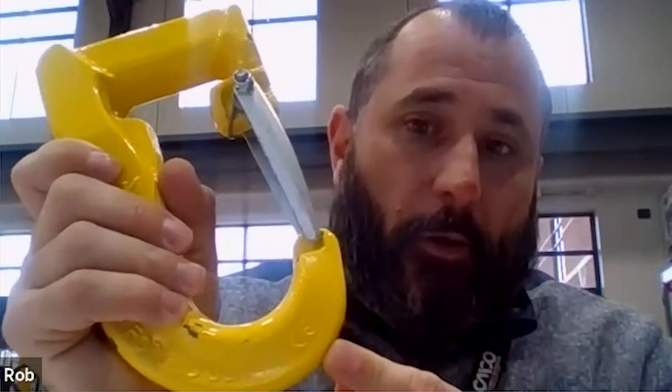One of the features listed on the website is that it's embossed for worldwide use. That means it meets ASME B30.10 standards, which is what's used primarily in North America, and it also has the CE marking, which means it meets European EN standards. So basically, wherever this hook is shipped in the world, it's going to meet the standards pertaining to that region. CE and ASME are really the two that everybody follows depending on where you're located in the world.